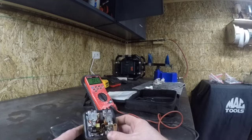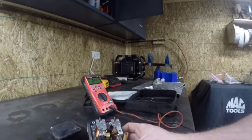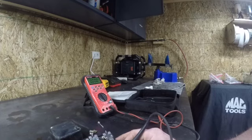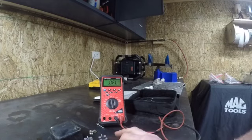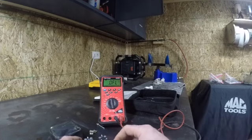If you wanna pull power from your amp meter to power your ignition switch, you can do that, and you can leave this L terminal unhooked. This will function 100% without that hooked up. All that's doing is connecting the load to battery at all times. And you can see there by my meter, we have continuity. Actually, I tested this off camera before I brought you guys on. This voltage regulator actually tests out okay.